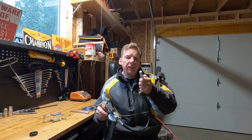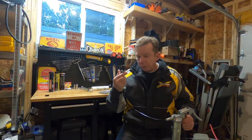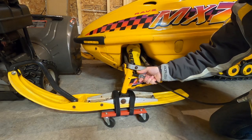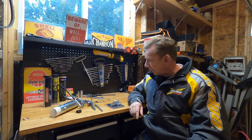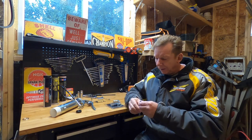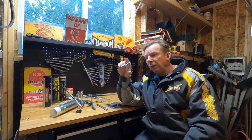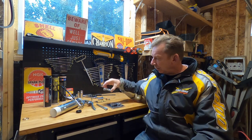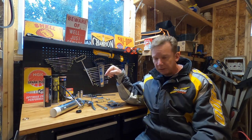There are also some attachments worth looking at. The standard four-jaw coupler can be pretty tight on those Zerks and sometimes takes a bit of work to get off — and when you're under the skid, there are a couple of places where it's tight and you can rack up your knuckles. So a lot of people like a locking coupler, which is far easier to put on and off the fitting. The one from Lube Shuttle is called Safe Lock and it sells for $49. Some fittings can be pretty hard to reach depending on what you're trying to grease, so they make a number of different couplers: a six-inch straight rigid tube for about $10, and a 90-degree elbow for about $27. They also have a number of different styles of guns — a cordless version, a pump style, and a pistol grip.